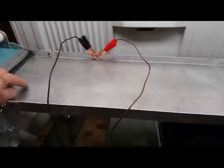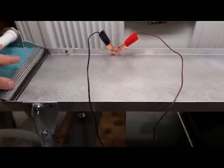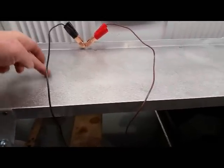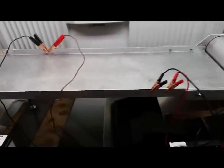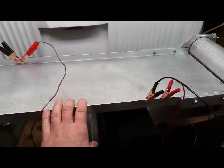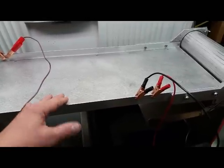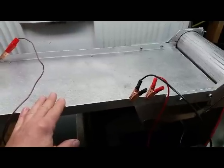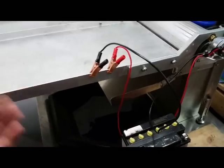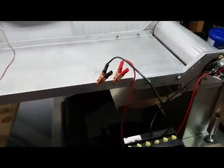You'll want to add your material basically right below this — this blue section is for water flow and control, to dissipate and flatten the water so it goes across the table smoothly. Your input is anywhere in this area. When you're done running, if you are running fine gold, you'll want to clean this table off because it's going to act like a miller's table. It's going to capture super fine gold that you won't be able to see with your naked eye. When you're done, take the time to wash this section off into a clean bin, tip it up really steep, and you may find quite a bit of fine gold stuck right on the top table.